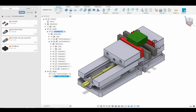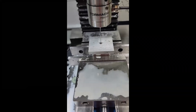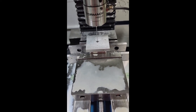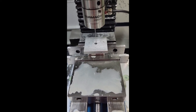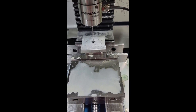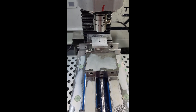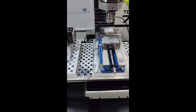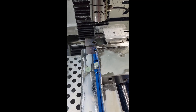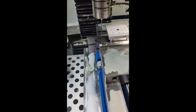Please like and subscribe. We're going to navigate to the Rec/Circ probe screen in Pathpilot and press Find the Center of a Circular Pocket. As you see, we've transitioned into the end of the probing and it will probe the center hole for us. Next, as the video transitions, we'll probe the bottom of the parallel, which will put us at the center bottom of our part so everything lines up perfectly for Op 2. Thanks again for tuning in.